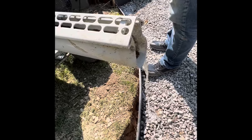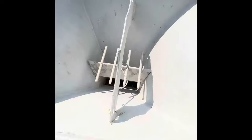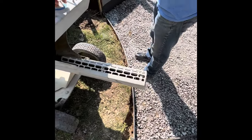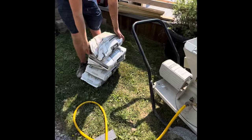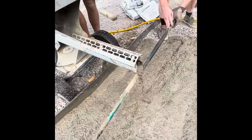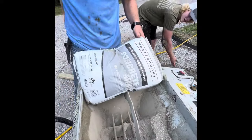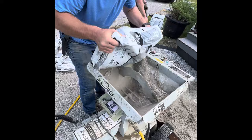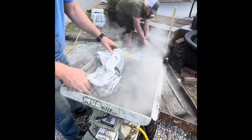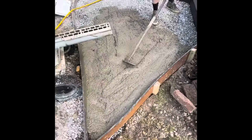On the right side you've got the red button — that is going to make the auger move either forward or backwards. If it gets clogged up you might have to backtrack it. The little dial controls the amount of water flow, and that water is going to mix inside this chamber here with your dry concrete. I was testing it out to see if I could notice a difference in the amount of water depending on the weather. This was a super hot afternoon so we wanted the pour to come out pretty wet. Dump the bags in dry — don't grab the hose and put water up in the chute because it'll clog it up. Just dump it in dry and let it mix down through that auger.